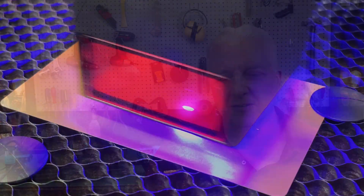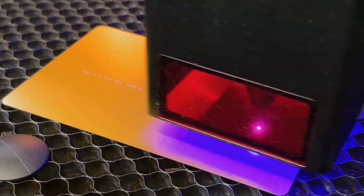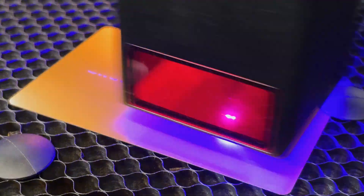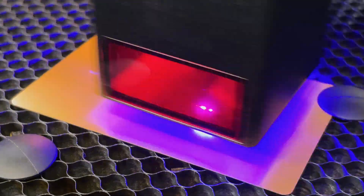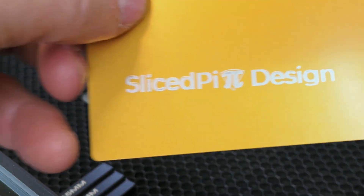Good all around from a performance perspective on wood. Since I had a big handful of metal business cards, I tried to do a quick engraving on those. You can see in real time how quickly it's going — about 9,000 millimeters per minute at roughly 100% power. It's moving along really quickly, and when you're done the results actually look pretty remarkable. There's my company logo; it looks pretty much as I would expect — it came out really well.